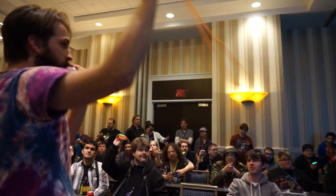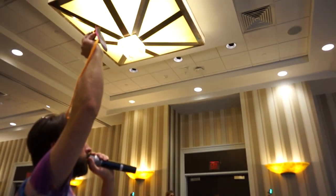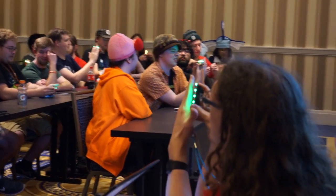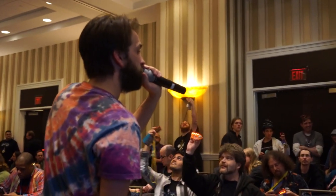Oh, okay, this is after that. So right now, I'm holding this up. Everybody hold up your badges. Okay, now make sure you can see them. And now move them around a little bit. And move them back to where they were. Yes, they were wired for deep sleep. It's pretty predictable what those waves look like. If you touch the antenna, the power will go down significantly. I'm hoping to make this available, but I just thought that was one of the coolest things. If you guys want to play with this some, I'm going to hold this down here so you don't get as good a signal. So now you all look better, you can see a little more clearly. Small changes in distance make huge changes in signal.